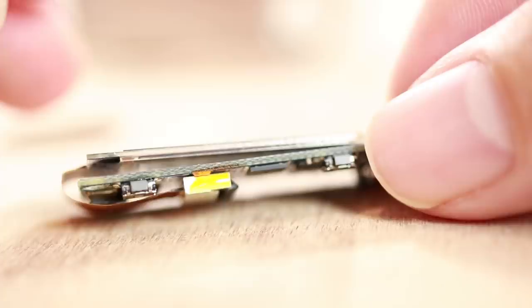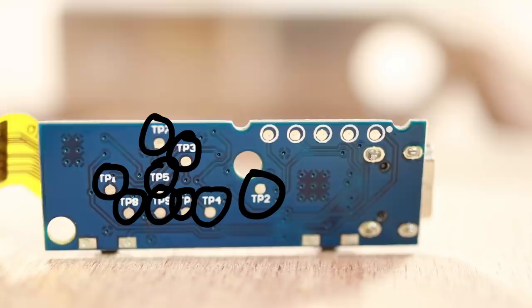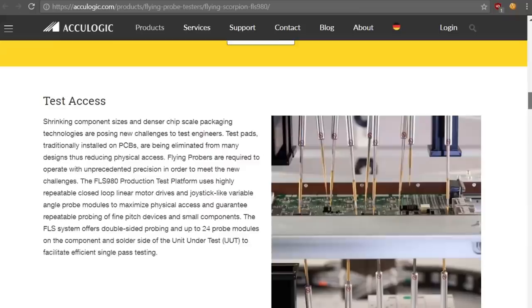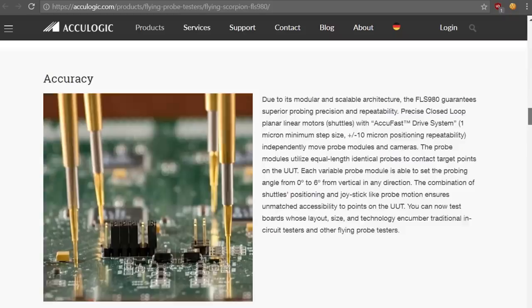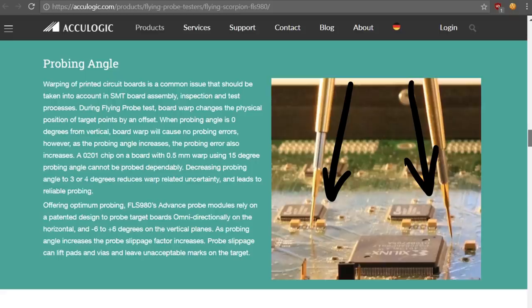Here it is from the bottom side, and we can already see some very interesting looking points. These TP-numbered points are probably test points. When you manufacture hardware you often expose test points — not necessarily outputs for debug interfaces, but usually just a way to verify that the assembled hardware works, with an automatic device coming down with needles and running tests. Very normal. But there are also a few unlabeled points over here that we'll get to soon.